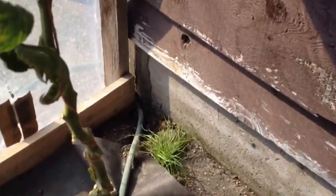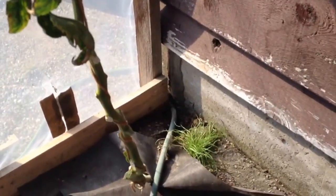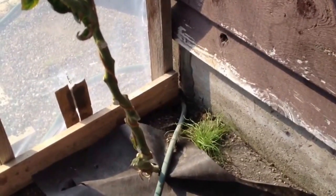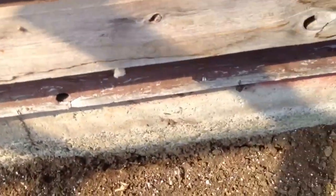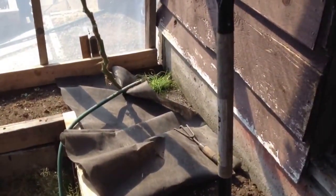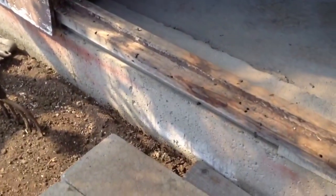This corner didn't come in quite as much as the other, but it's still about three inches better than it was. I patched that up and that's much better than it was anyway. You can see the bottom of the footing here — how it's raised up everywhere, and it should settle down onto the inside of the footing as time goes on. The old guys always told me to take these things real slow, and I think they were right. When you're shifting a building, it needs time to settle in.